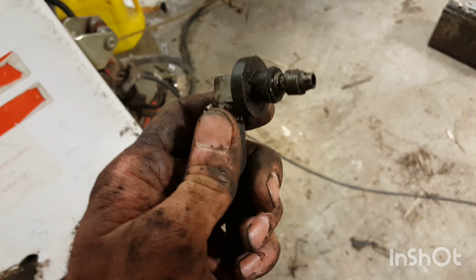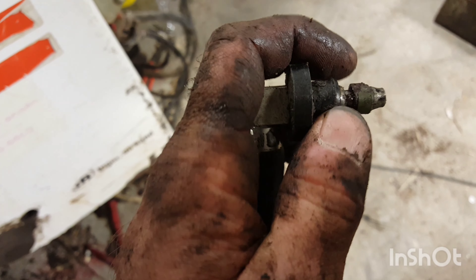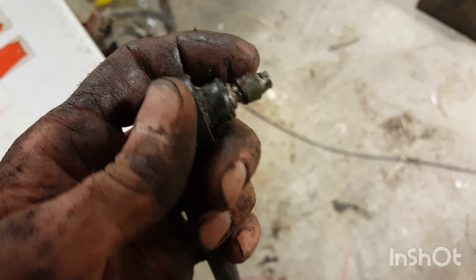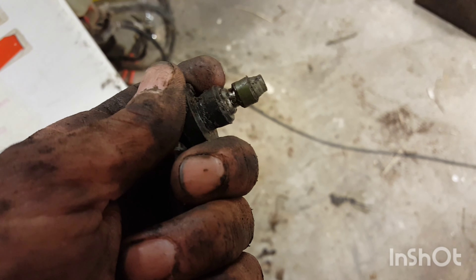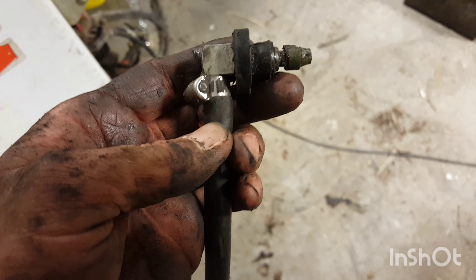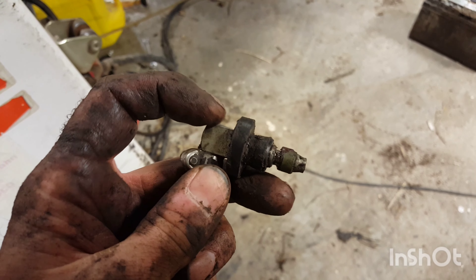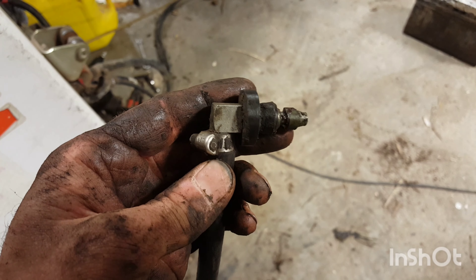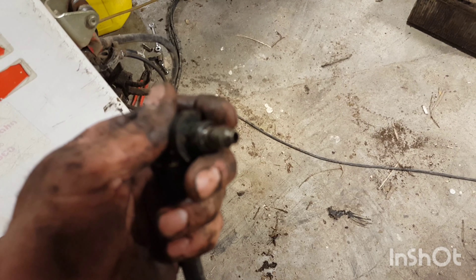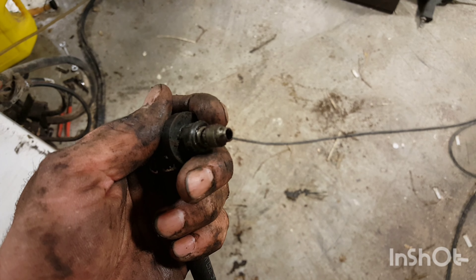I shoved the rubber grommet back on to show you. You can see the clamp on the hose — the hose is brown and there's a green clamp. It's mostly clamp at this point. The old hose is brittle and just fell apart in there. The machine has about 3,000-plus hours, so I don't know if they've ever put a new one in before — maybe that's the first one and that's just how long they last. Plan is a new line, new grommet, and probably a new 90 — might as well go back in with all new stuff.